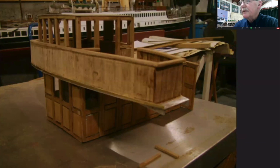As I've described, the two large-scale models were mostly built of plywood GRP, and the real steamers were steel. I always felt that the small details, the whole effect should be metallic to get that realistic effect. I remember seeing a model of Waverley, which had been constructed of steel, and it just looked metallic because it was. I had used aluminium sheet to make some repairs on the Duchess hull where there had been some distortion, and was impressed by the effect, especially when I'd drilled holes and placed some pinheads to represent rivets.